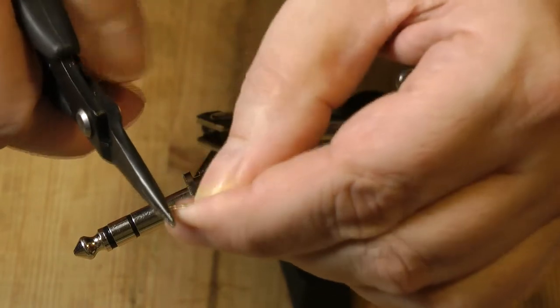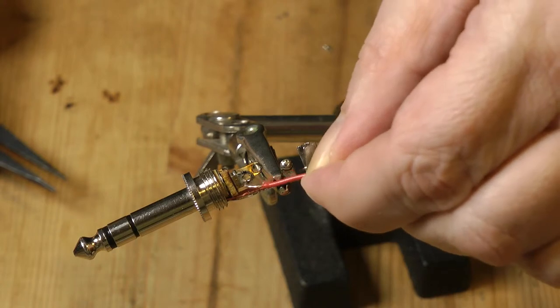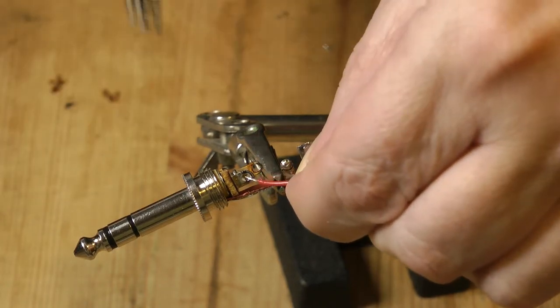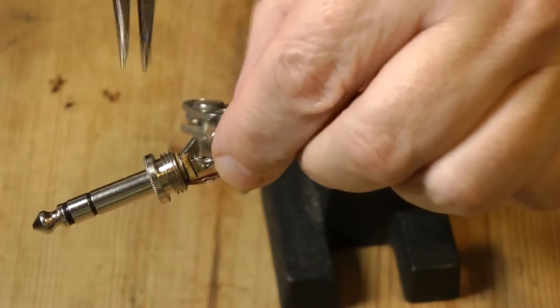6. If possible, make a mechanical contact between the cable and contact pole. You may need to bend the cores with a pair of pliers. Some connectors have holes in the connector you can push the cores through.